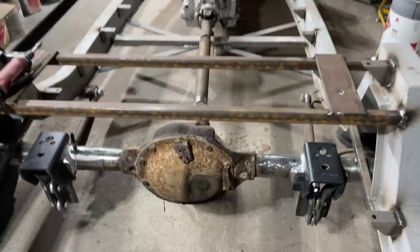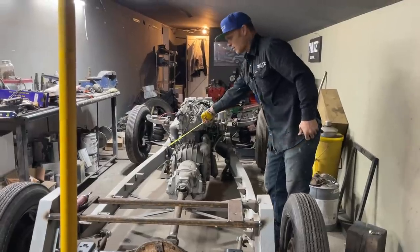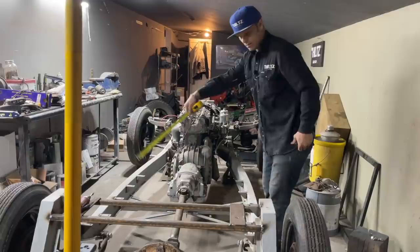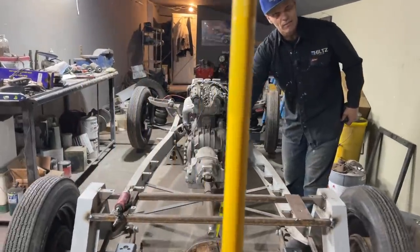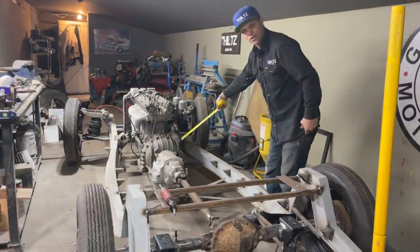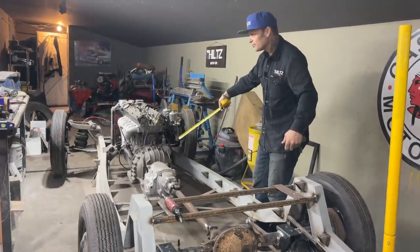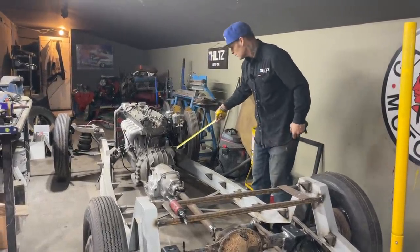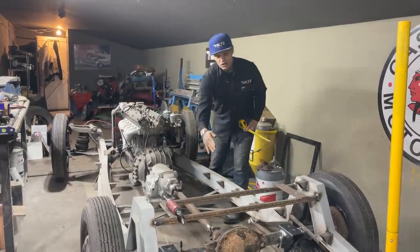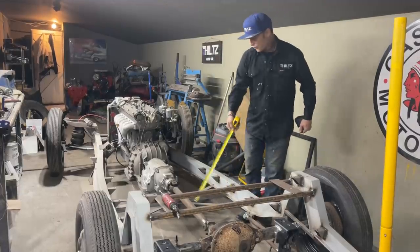When I said you could put your engine in a little bit crooked to miss maybe clutch pedals or brake pedals, I'm saying that because the factory did it with the rear end. We have a universal joint on the end of the motor. Why can't we do it with the engine? And you most certainly can. Someone got a little mixed up, I guess, but you're allowed to bring this engine over a little bit and run the drive shaft crooked. The factory does. The universal joints, that's what they're for.